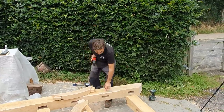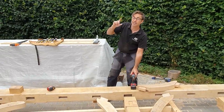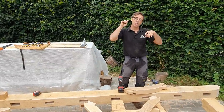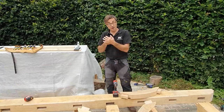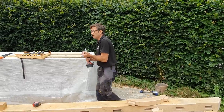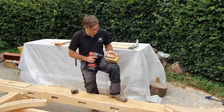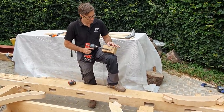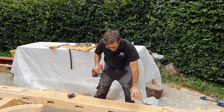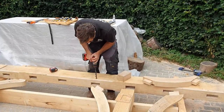Then it's a matter of drilling my holes all the way through the mortise into the other side. I use a bit which is a set length, so I know I can't drill all the way through — my pegs are going to be driven through from here, hold everything, and not come through the back side. They are going to go into the opposite side of the beam to hold it. My auger bit — I know when I drill as far as this shoulder here I'm deep enough for my peg to pass through without smashing through the outside. I've got a nice sharp auger bit, so it's just a matter of going through that nice pilot hole.